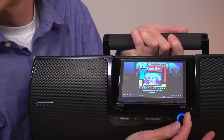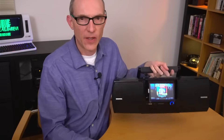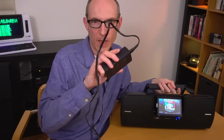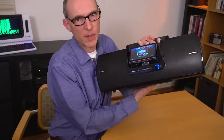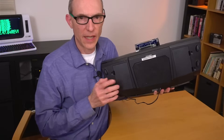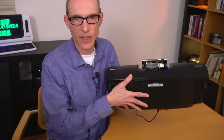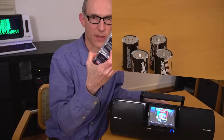This particular model uses a rotary encoder for the volume control, which is nice because they tend not to get noisy with age. This box came with a 12-volt power supply, but it also has a place for 8 D-cell batteries, 4 here and 4 here. Internally, it converts the voltage to 5 volts available on the connector. So, let's load in 8 D-cells and see how well that works.